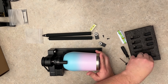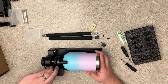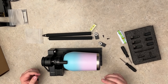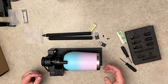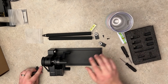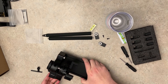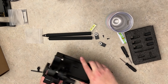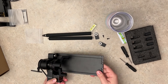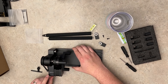You'll use this little chuck tool here, then tighten this up — make sure it's nice and snug. That way your cup isn't going anywhere and it'll laser engrave properly. Now if you have a cup with a handle, like a mug, you can undo this here, take this entire plate off, and move it to this side by removing these two screws. Those two screws go into these two holes right here, and that will offset it so you can raise it up so your mug won't hit the bottom. That's how you would do a mug.